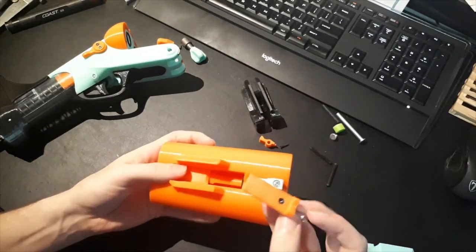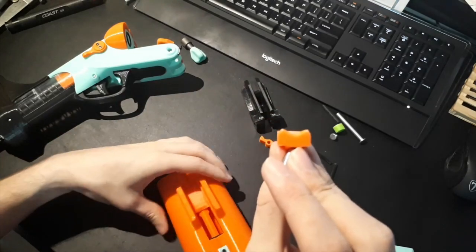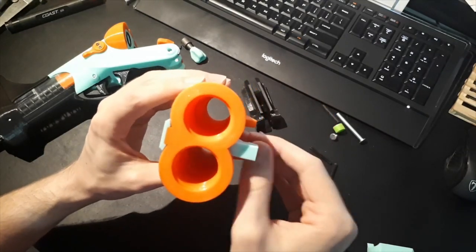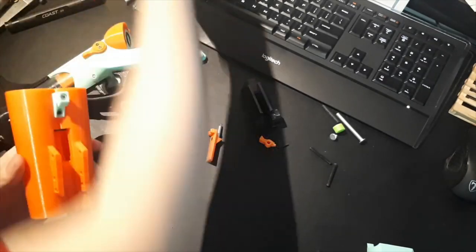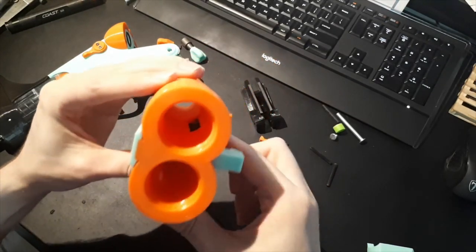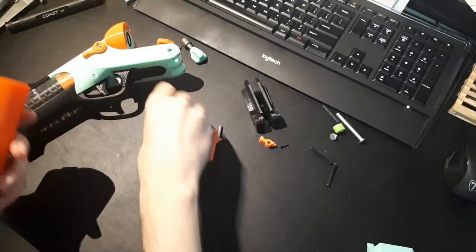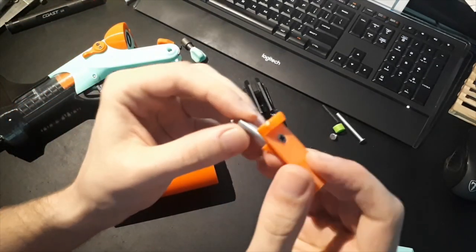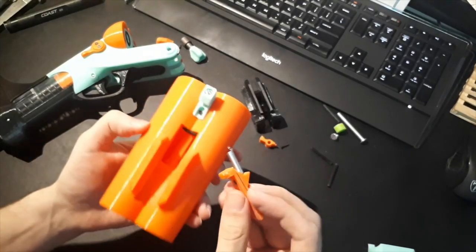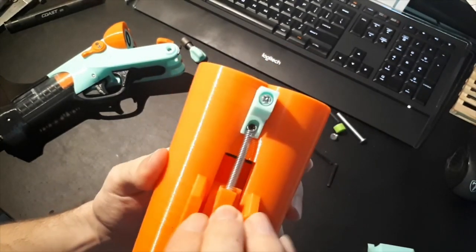The orange piece pivots on the rearmost printed pin. The ejector has two little points — this is what contacts the shell in the barrels. Here's a black one of the same piece — it slides back and forth. When you look down the barrels, you can see the little black nubs, and that is what catches the shell and kicks it out. There's a screw hole, and you simply put the screw through the loop of your extension spring. On the other side there's a hook with a hole for a screw that you don't thread all the way in, so you can hook your extension spring onto it.